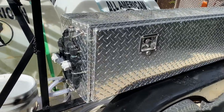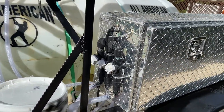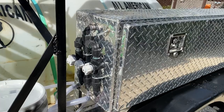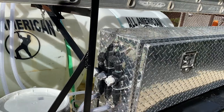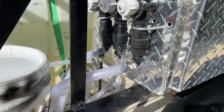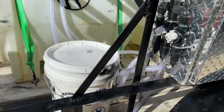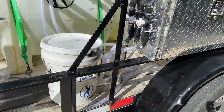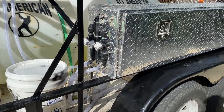But we'll start with the outside. There's the proportioner. What this does is it meters the chemical from the chemical tank and the water from the water tank into our pump. There's also the middle valve that has a smaller quarter-inch tube that goes into a soap tank. Currently, because this is brand new — I just built it a couple days ago — we're just using that bucket for the soap.